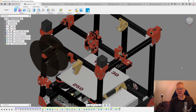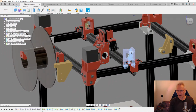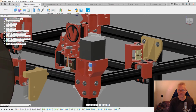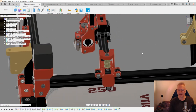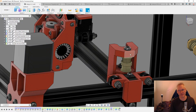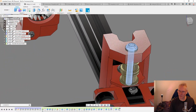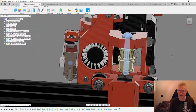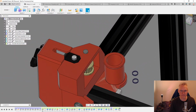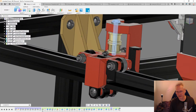Okay, so I did talk about something. Yes, I have one issue with my V-Baby, and it's resonance. These towers seem to resonate a lot, and I don't know if the resonance comes from the motors or from these towers. Especially on low speeds, like 60 to 100, or maybe even 30 to 100 millimeters a second, I have a lot of resonance here. And it might be the bolt, because the bolt is not a good solution either. We should have bearing shafts, and I did buy bearing shafts, so I'm going to change. I currently have screws here. These are bearing shafts, so I'm going to change over to bearing shafts, and I should have that here as well, but I don't know if it fits.